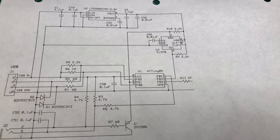And there's an important note here: you must install the software on your PC prior to connecting the Ensemble to the PC. I've already got it on the laptop that I'm going to demonstrate after I pull the circuits together, but apparently failure to do so may result in various driver problems, and that'll get you into a whole pile of trouble. There's a link below to the software install instructions. They're quite straightforward. There's some driver software you have to install, and there's a little testing user interface that you have to install as well, which we'll be using later on to demonstrate that the functionality is working. The ATTiny itself comes pre-flashed, so you don't have to install anything on that.